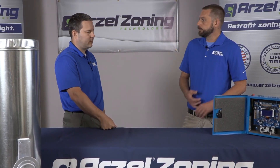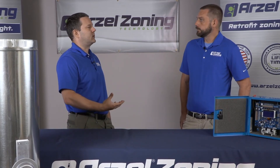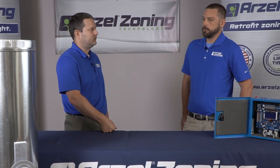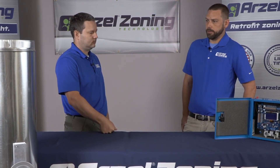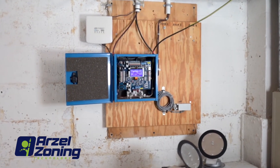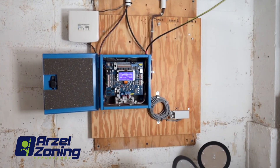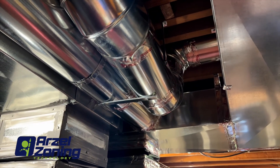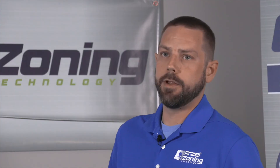One of the things I've heard from contractors when it comes to finished basements is: how do you get the control tubing run? Typically with insertable dampers, you're going to run that tubing through the ductwork, and really the easiest way is just your fiberglass fish tape. You put a ping pong ball or something on the end to prevent it from getting caught in the seams of the ductwork, then you slip it through the duct, tie your tubing to it, and pull it back through.